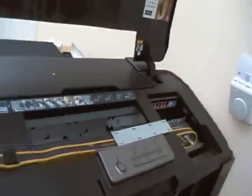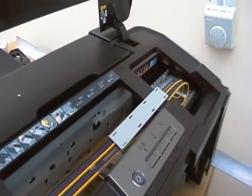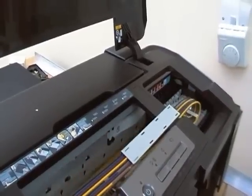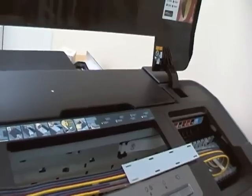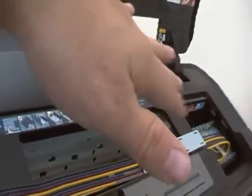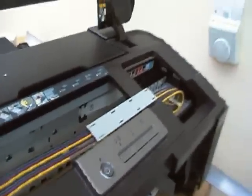So that's pretty much it. I'll turn it on and show you what it's doing. I think it will give me the typical two orange light error when I turn it on — let's see. There you go, you can see the two orange lights flashing. I've worked out that if it wasn't quite so bright I don't get this error. I think it has to do with the PW sensor under the printhead detecting if there's something there, and the amount of ambient light affects it.